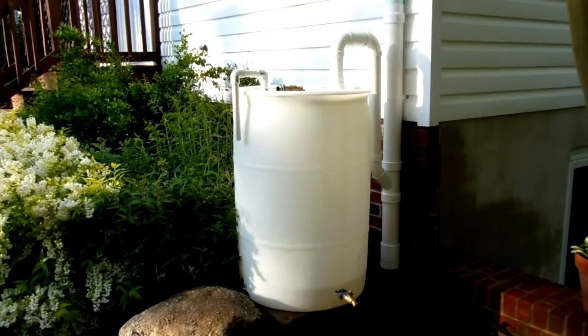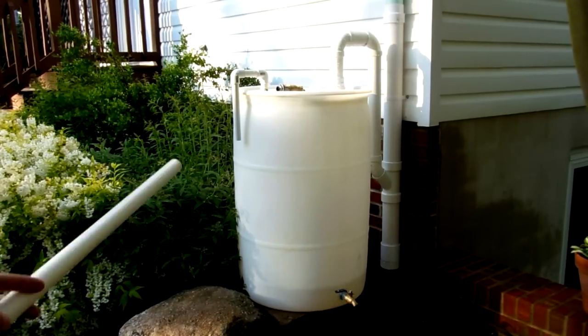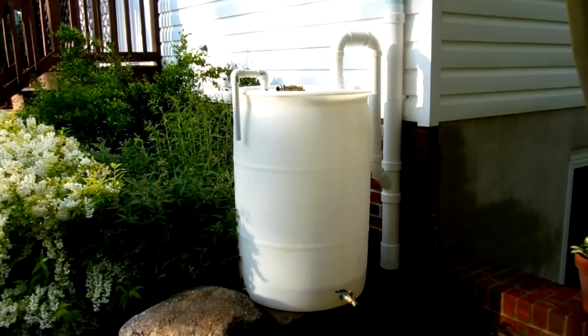On the left side we have a drain which is just a three-quarter inch pipe. I know a lot of people say you need a bigger drain, but unfortunately due to the bung limitations on this barrel I couldn't do it — I'll show you why a little bit later. This particular spout only drains about one-fourth of the roof, so I've never really seen a tremendous volume of water. That down pipe there is just a temporary solution; I'll have to run it down to the ground later so we don't get as much splashing, and probably run it out to the grass.